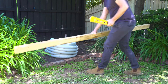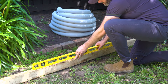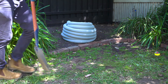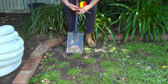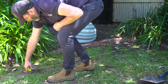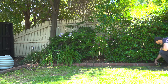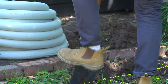First, work out where the high points are to ensure the pipe is running from a high point to a low point. Water isn't very good at running uphill, so your high point will be the furthest point away from the connection to the drain. Mark out the area of the trench with pegs and string line. Trench width should be around the width of a standard spade, approximately 200mm. As a general rule, the trench should have a minimum fall of 1 in 100 — which means every 100m the pipe should fall 1m. In this example, we have approximately 6m of trench Drain Coil, so our fall should be 60mm from the high point to the drain connection low point.